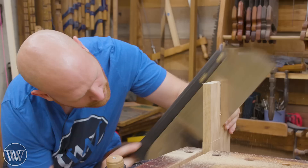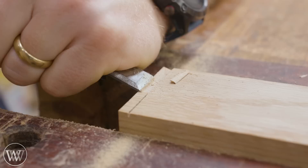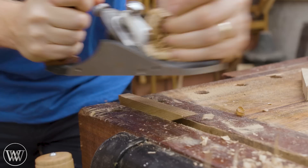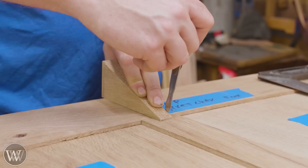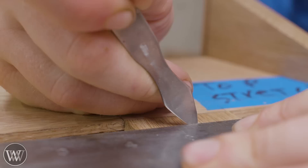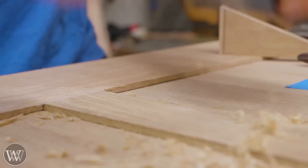The two corbels that go into the legs are smaller - only about three inches long. But there are three that go in the main body and those are about five inches long - a slightly different design. These only get dovetailed into the top; they just go into a regular dado in the main frame body. We can use the saw to cut these down at an angle and every time we cut them we get two. Plane them off and we're ready to work on these as well. In the main body they go through the top stretcher and stick down a little bit into the vertical - I kind of like that look of it breaking up that line on the arch.